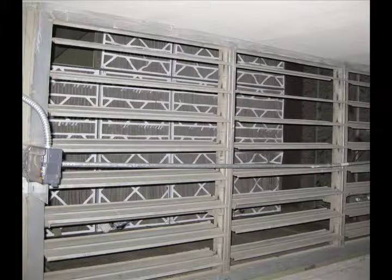We can vary the temperature of air that we're going to inject in there by using this set of dampers here. We can actually mix a little bit of return air in with the air coming off of our heat pump to reach a particular temperature going into the fan.